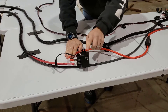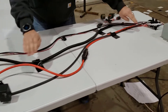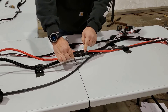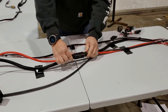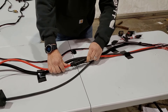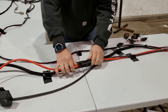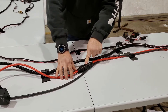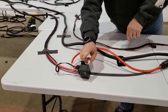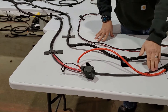Plug that back in. Once it's switched, it's going to allow power to flow through. The power going into the relay is coming directly from the battery. There is also a 100 amp mega fuse located in line, bolted to two pieces of four gauge wire, to provide safety for that relay and the ECUs. If it is loose, you might get intermittent power because it may vibrate, causing things to turn on and off — so if you have a problem, that's one place to check. You unplug it and plug it back in. Once this is powered, it's going to send power through this four gauge wire back to the ECUs, and the ground comes directly from the battery.